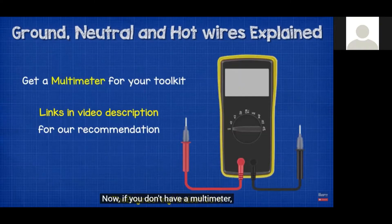We need to understand grounds for two reasons: first, so we can take steps to avoid connecting to them; and second, so we know what good ground references are during troubleshooting when we're at different places in the building chasing a ground fault. We need to know whether the thing we're using as a ground reference will or won't actually be a reliable ground reference. The video talked about grounds being used as a safety return path — if a wire makes contact with any metal, it gives electricity a way back to its source so it doesn't try to go through a person.